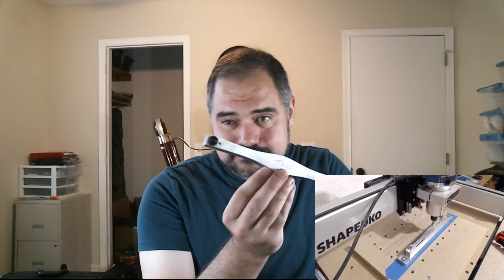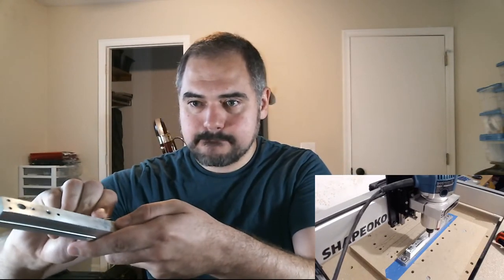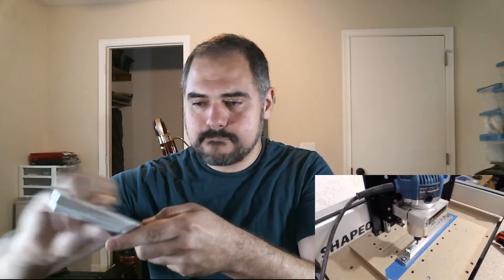So, honestly, Crumhorn shapers are a little bit extravagant. But the main reason I went ahead and decided to make a full set of Crumhorn shapers is I need to. Right now this is just 6061 aluminum, pretty soft. Something like an X-Acto blade could cut it pretty easily. Let's see if I can demonstrate that. Yeah, it's taken off some little tiny slivers. Now obviously for a shaper, that's not really going to work because you're constantly cutting along the side of it with an X-Acto blade.